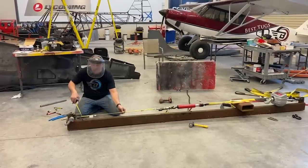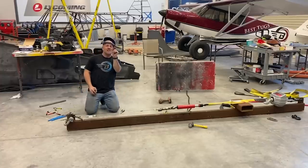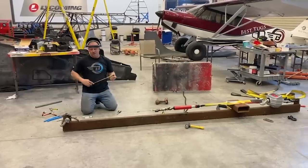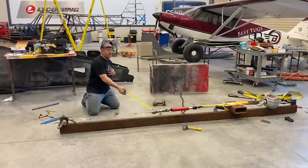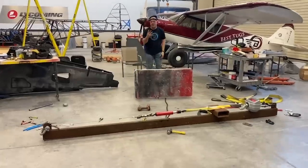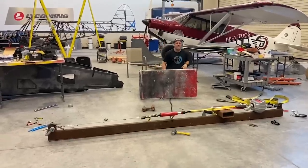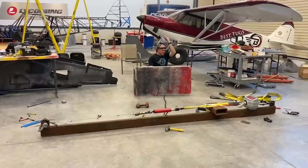Okay, we're 37 5/8 of an inch. This bar has grown over a half an inch. That bar is toast. So three indications. First was the bar, second was that component. Third is the bolt attach point is stretched. I'm not getting closer. Three failures have already occurred where this would be completely done, not usable. We're gonna go till it shatters. Complete, absolute failure. Here we go.